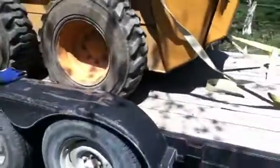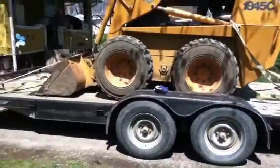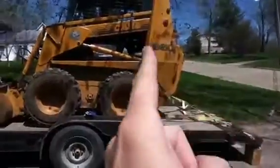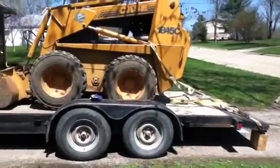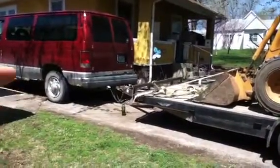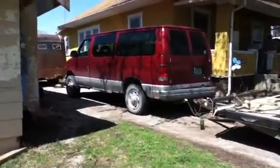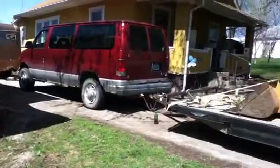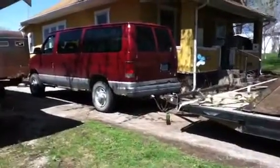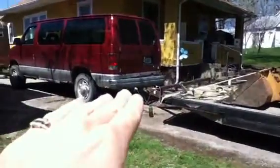You want to position your load correctly. I'm parked up here — it looks like it's too far forward, but it's really not, because almost all the weight on this skid steer is right in the middle. You want that weight about even between the axles. You can use a tape measure if you're picky, but the key thing is you want your tow vehicle to sit flat once fully loaded — no more than a two-inch drop from your bumper height empty versus loaded.